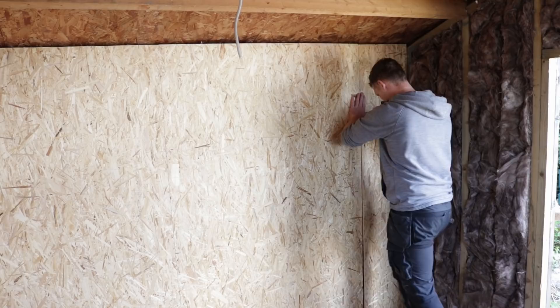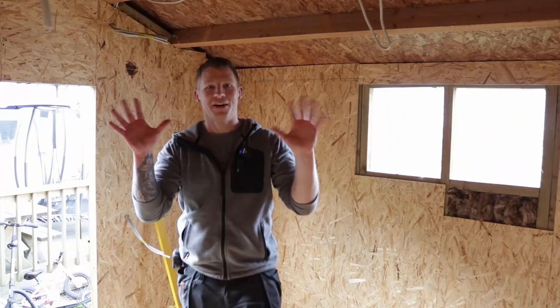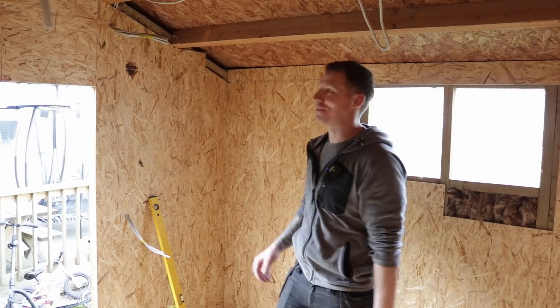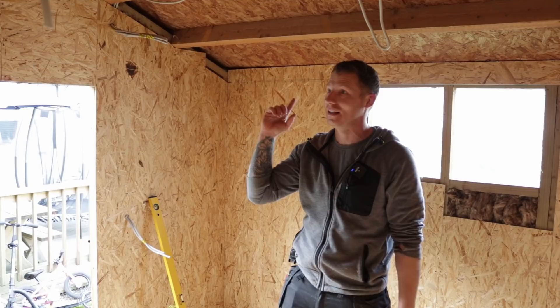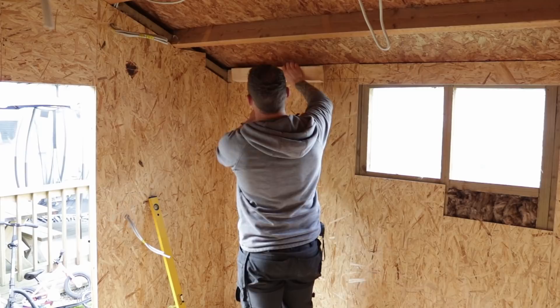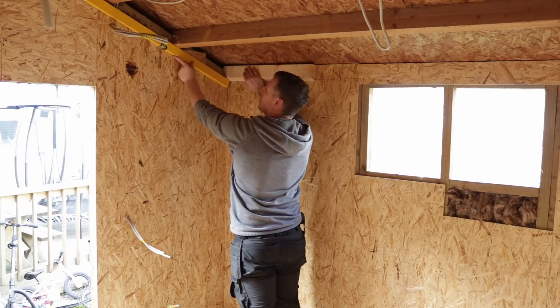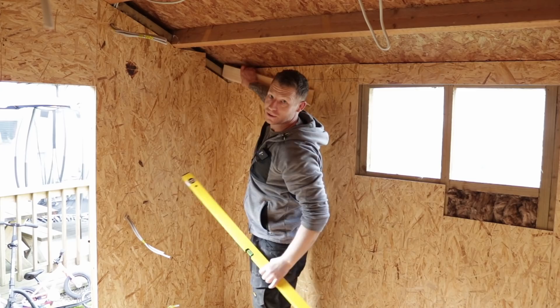I just pop it in and screw it home. Joining the ceiling along here is going to be an issue but I'll show you when I get to it. The walls are all clad with OSB — it's been a long day. I want to get the ceiling done before the day is out, so we need insulation and boards on the ceiling. The issue is I've got nothing to fix to on the wall side. So I've taken a two-by-four, put roughly a 20-degree bevel in it, and I'm going to fix that to the wall to give me a nice fixing all the way up the ceiling.